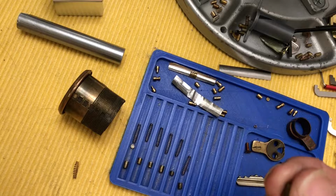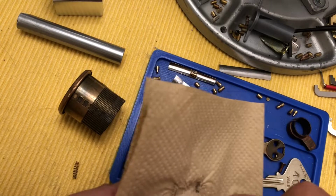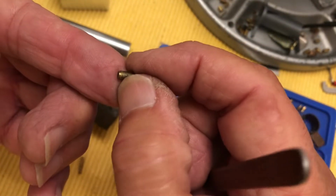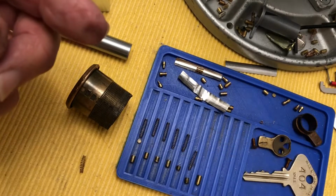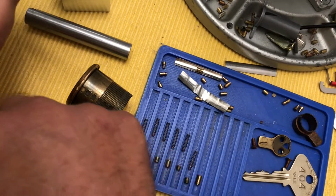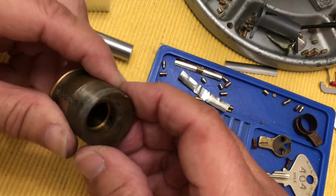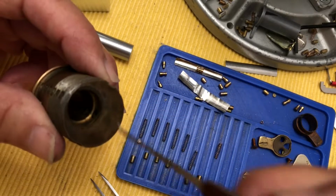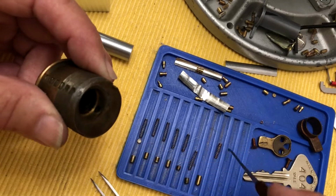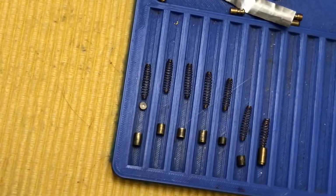And this little dirty pin, which has, whoa, sorry about that, a little reduced end on it, and this spring holds the tension in there. Keep that pin set. Interesting. So you have that little bevel in the back here where this second actuator or cam rides, and it's retained by this little spring pin. I'll give you a close-up of the pins if I can.